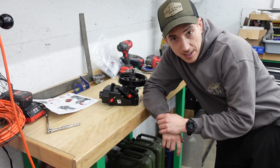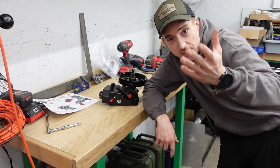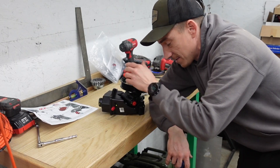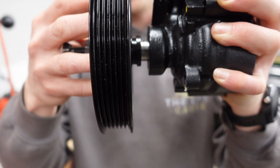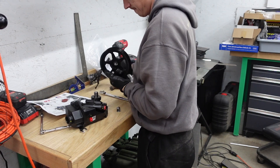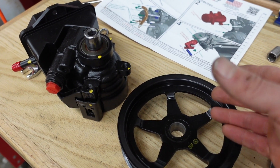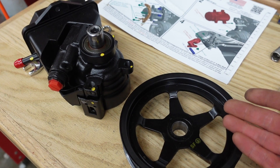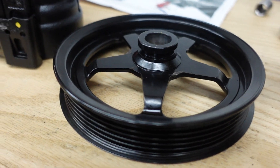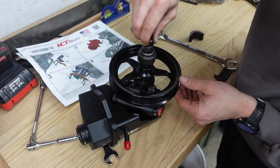I went ahead and got a new camera, and paying attention to the new camera while recording instead of what I'm doing — I put the pulley on backwards. We'll have to undo that; at least I didn't get it all the way on. How did I notice? I'm looking down thinking how am I ever supposed to remove this pulley? If you put it on the right way you have the lip and the puller jaws grab around that lip. Since I had it on wrong we had to get the three-jaw out. Take two.